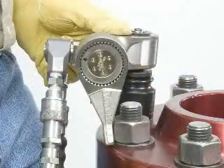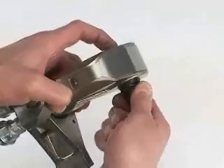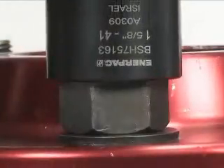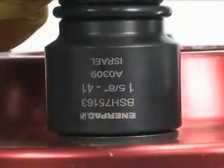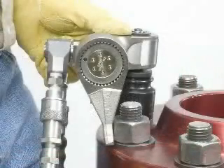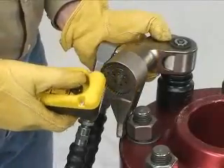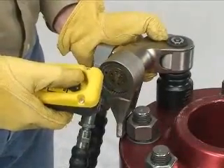Tightening and loosening positions. To tighten a bolt, you may first want to make sure that you are using the proper lubricant to assist in the process. Fit the drive shaft to the tool as shown. Position the socket over the nut you would like to tighten. Position the reaction arm against a suitable reaction point. The reaction point will counteract the force caused by operating the tool.